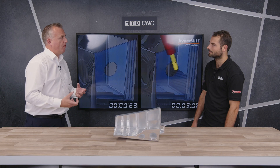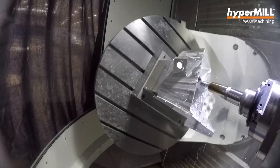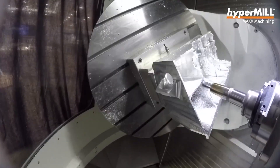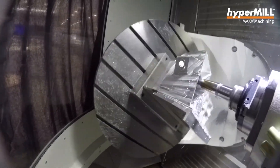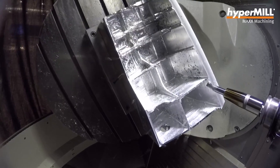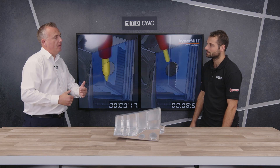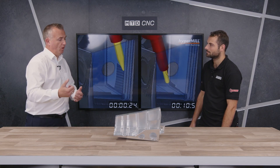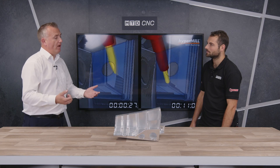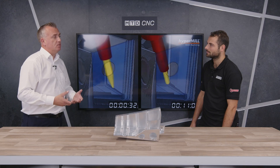It's very straightforward to use. Some people might consider that the resulting surface looks different to the surface you get from a standard ball-nose scanning process. With the very large step-down — in this case seven millimetres — you will notice some banding down the part. But it's about hitting that surface finish requirement that's on your drawing, and you will find you are getting exactly the same RA value as you are using a ball mill. That really does equate to a 90% cycle time saving.